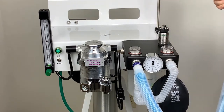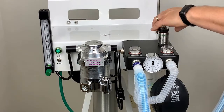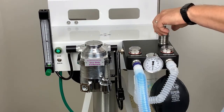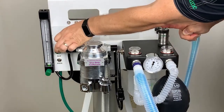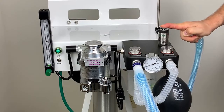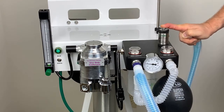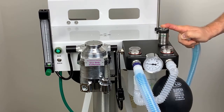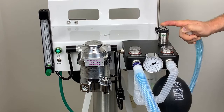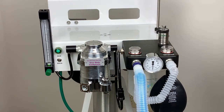Once I release the plunger, it is wide open again. To run a leak test on this machine, I simply dial down the disc, close the plunger, and give it a little flush. I like to build the pressure to 30 cm of water. As you can see, this machine is leak-free. But notice, the moment that I walk away, this valve will automatically open. Therefore, it is impossible to leave it closed accidentally.